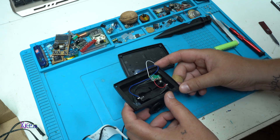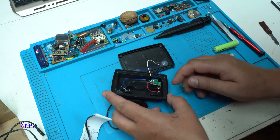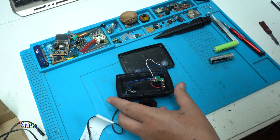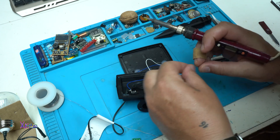I already found out why this solar garden array with 10 LEDs is not working. The switch is faulty, and this point here is not properly soldered — it needs a little bit of solder.